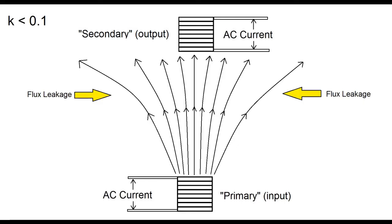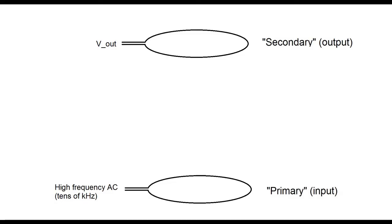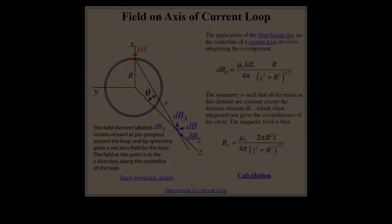In an even more extreme case, the secondary can be far away from the primary and still collect power from it, but the coupling coefficient is less than 10%, and the overwhelming majority of the magnetic flux simply leaks out into space. However, if the primary is putting out a lot of power, that small coupling coefficient can still be enough to generate useful power from a distance. For my wireless power system, I'm going to do this with single loops of copper tubing instead of coils with many windings. However, a single loop of wire has a very low inductance, so I'll have to run my primary at tens of kilohertz to avoid blowing it up with too much current.